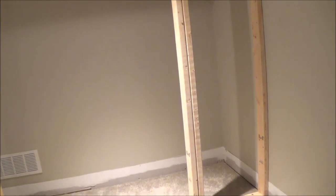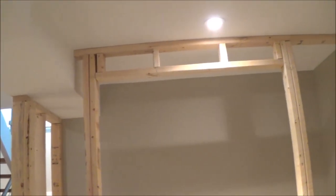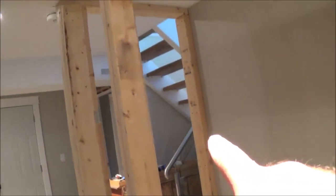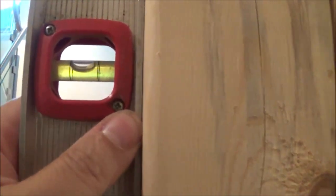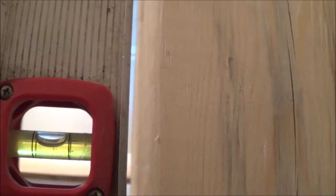I put all the pieces together and I'm really happy with the job - not just because I've done it, but because it is solid. I was able to find nailers everywhere. This piece is right against the stud, the entire top plate is into the floor joists above, and we've got nails into the cement floor - although that was a little trying. The only thing that isn't ideal is that I couldn't maintain level on this box up top because it was not perpendicular to the wall. But for framing it looks solid - you really had no choice but to feather into the existing wall with your half-inch drywall.